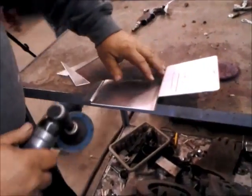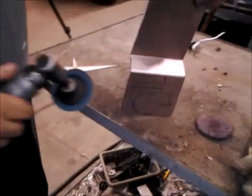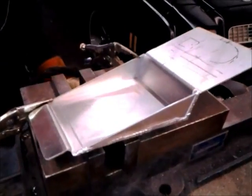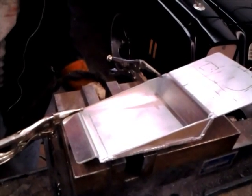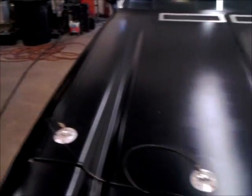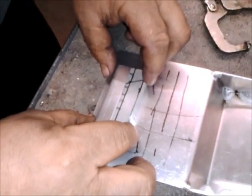What I'm doing is getting it ready to weld — tapered in so the weld will stay in there. We've got the sides on our console block-off plate fabricated, and Scott Etheridge here at RRC is going to TIG weld the end to the unit. This little piece right here is going to be a spacer that will give just the right amount of standoff to the front of the plate.